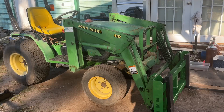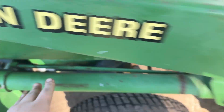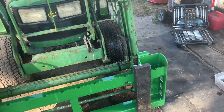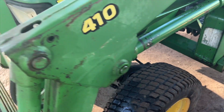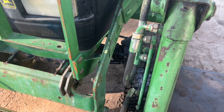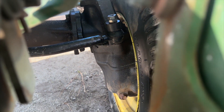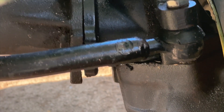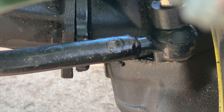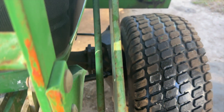So I'm doing a few more things to the 4100 today. I ordered some seals for these cylinders — I got four sets and two of them already came, so I've been working on that. As I was working on this I noticed down here — the reason they sold this tractor listed in the listing was that the front axle leaked. And if you look down here, you can see how loose those bolts are. It almost looks bent because it's being pushed out by the weight of the tractor sitting on the front wheels. There's a big gap there, and it's actually even missing a few bolts — I think it's supposed to have five and I only see two or three.